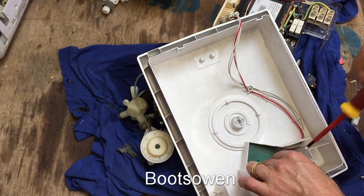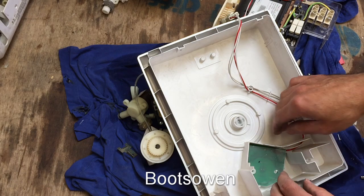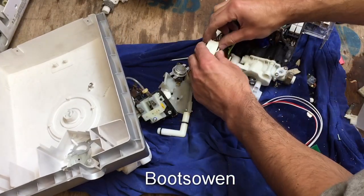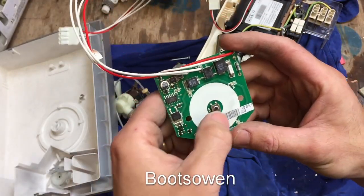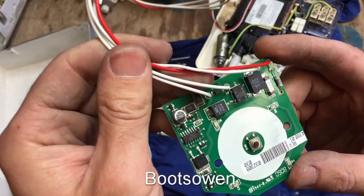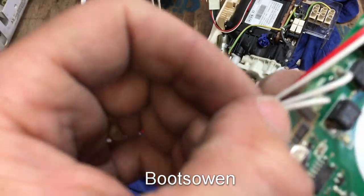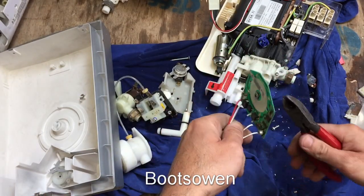So there's this - they're very simple circuit boards by the looks of things, but let's see what's in here. Is it a diaphragm switch? A lot going on there. So that's the cover gone, and this clips on here. Yes, it's got a momentary switch here, and there's a little surface mount stuff going on - that's quite a complex little board. It looks like there's a bit of heat damage across those resistors - two large resistors, and there seems to be a bit of scorching on the back. So I'd say that's dead.